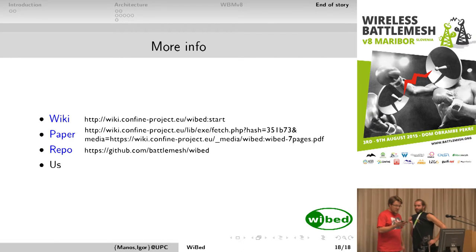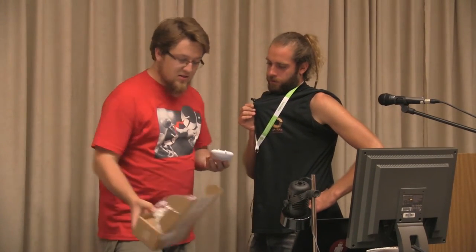First, we have from ARM University. I'm going to share them around. Feel free to take one if you want to play with it after the event. Something not to take home, which we'll use in our network, but for a start, are these LigoWave, or actually, the previous name was Deliberant, 5 gigahertz, 2x2 MIMO devices. So they run the Atheros chipset, and these are all new devices. A 15 dB one, a 20 dB one. And on the pole, you can see a dish with a feed, which is 28 dB.